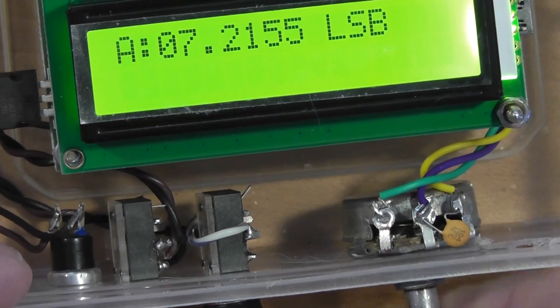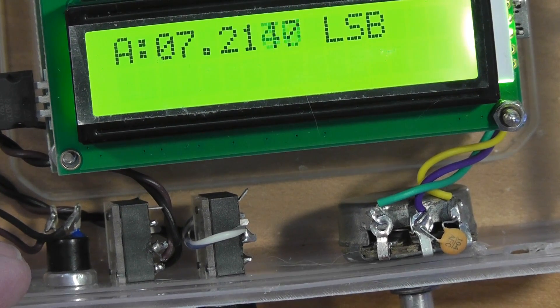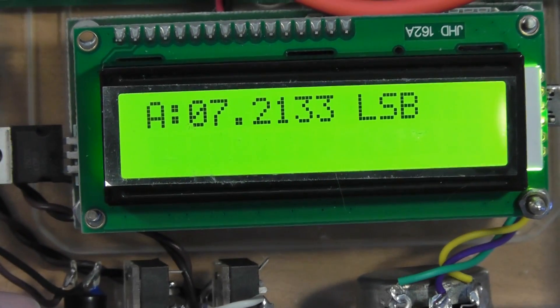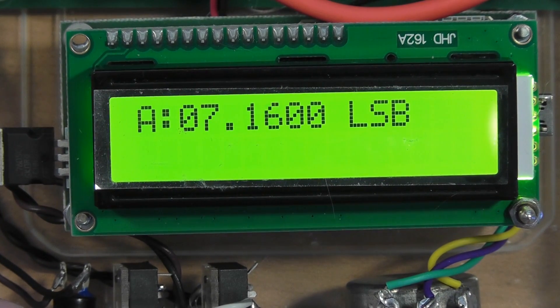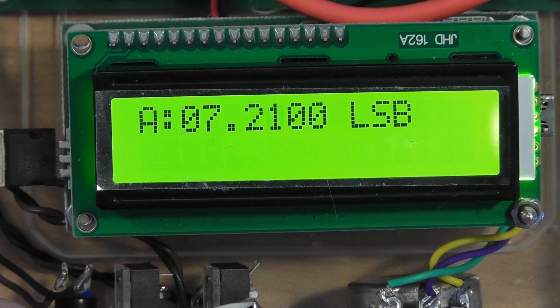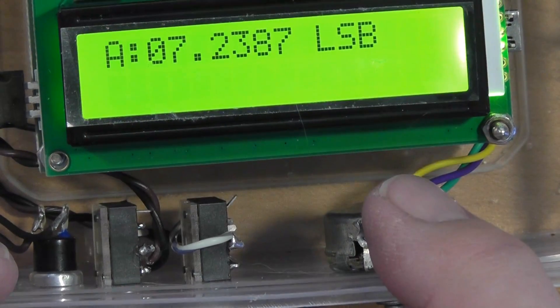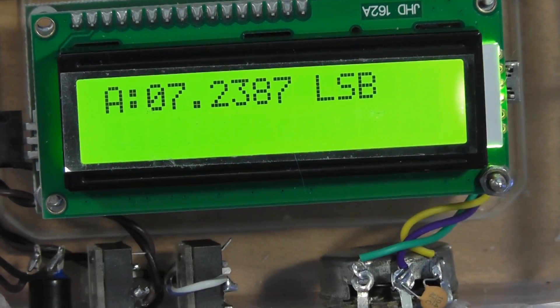A push button to short out the connected resistor will allow it to start tuning up or down. Another fix I want to put into software is to allow for jumping at 3 kilohertz intervals — that way I wouldn't miss any band activity. Some folks on the forum have talked about using a rotary encoder along with a software change. I'll leave that for another day, but that's the direction I'll go.